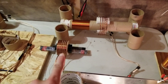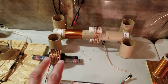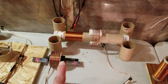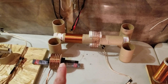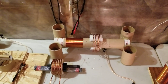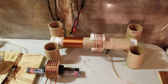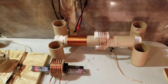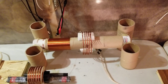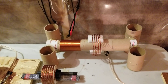There's the primary and secondary here, and the weight in copper is exactly the same. There's basically six turns of four wraps inside, with 24 turns on the secondary. These six turns are actually all in parallel - so basically a six-turn primary, 24-turn secondary. The resonator was measured by weight to be the same as the secondary and primary, and the top load on the resonator is the same weight again.